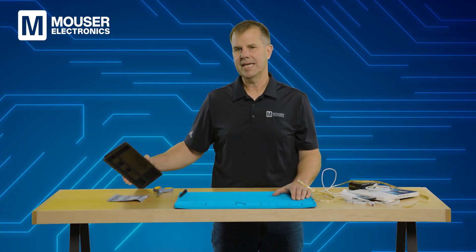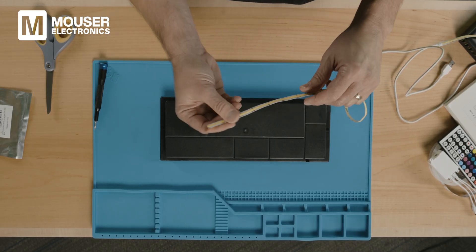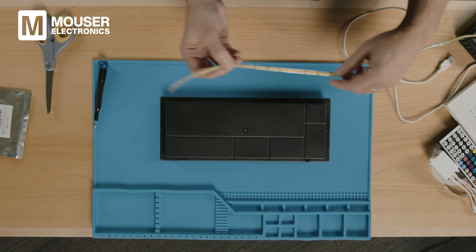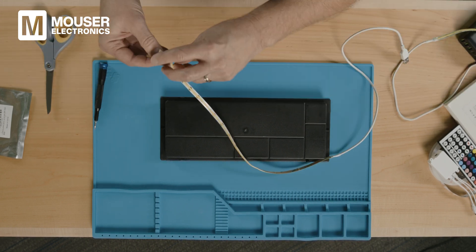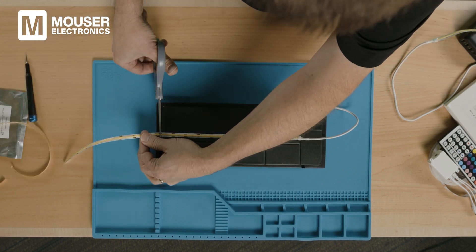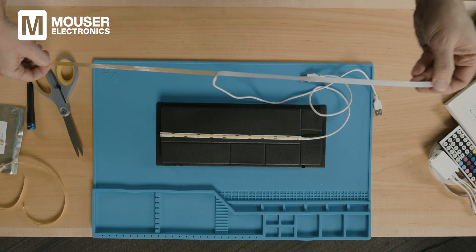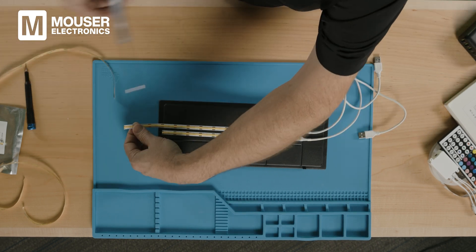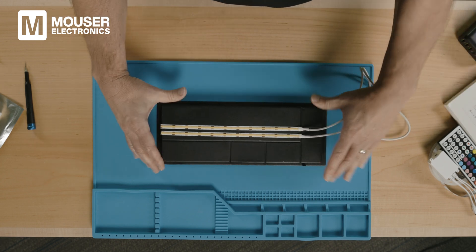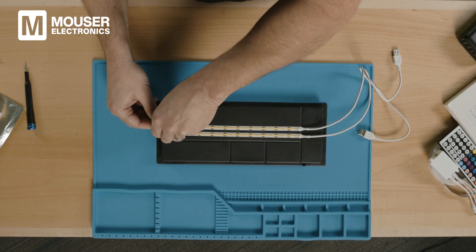Now let's take a look inside to see how these products have been engineered. We're going to begin with the white LED strip. The white LED strip has a light diffuser on top, and the strip is designed to be cut in the middle of the two copper bars. I'm going to use the adhesive strip to mount a piece here, cut this on the end, and attach another identical strip next to it. This is going to allow us to compare side by side with and without the diffuser, which means I've got to peel the diffuser off of one of them.